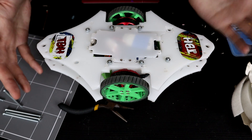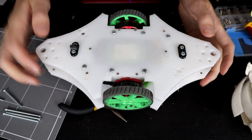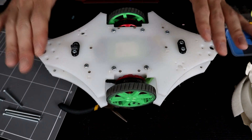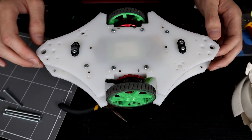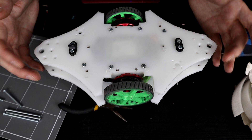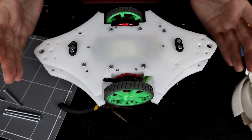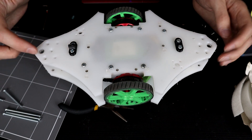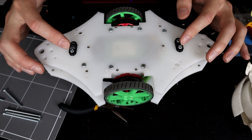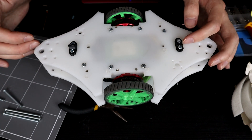Between those two tests, you can see the importance of the feet under here. We've got two little skids that actually help the MeltyBrain stay up and not rock too far. In the first test with no skid at all, we got wild fluctuations in the heading value when the outside edges touched the ground. But these skids helped out a lot — until I broke one. So I'm now rush printing a whole brand new set of those.